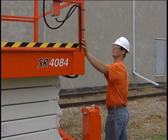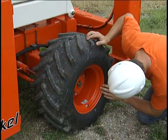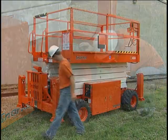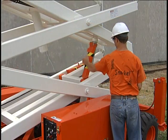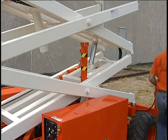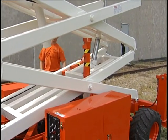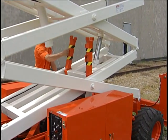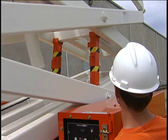Check for any structural damage, loose bolts, or broken welds. Check the tires and wheels for signs of damage and make sure all of the safety features are in good condition. The safety prop is used to support the scissors structure when access to the scissors arm, components, or chassis is required. Always use the safety prop when the platform is raised during inspection and maintenance.